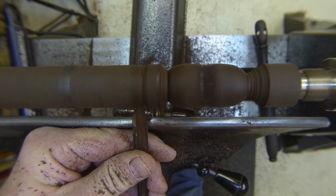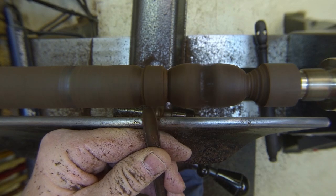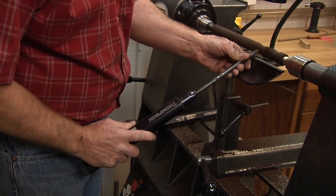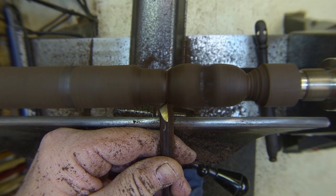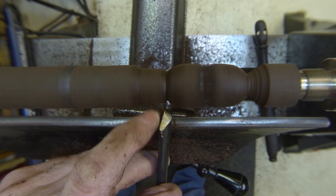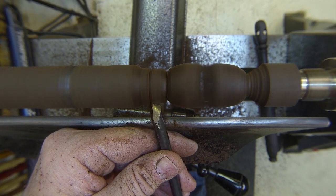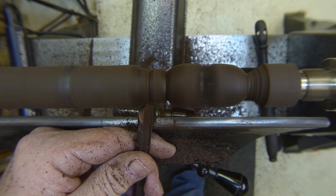It's almost like a V-cut. You don't really have to do a lot of curve. And then I want to bring this down, so I'm just using it like a roughing gouge. I'm sweeping it back and forth. So that's my height. Now, here comes the fun part. I'm going to turn and take that point right into the wood there. This shape is determined by the shape of the tool. You can see the angle it makes. I can't make anything more aggressive than that, or the sides will start hitting. So there's the start of my bead right there.